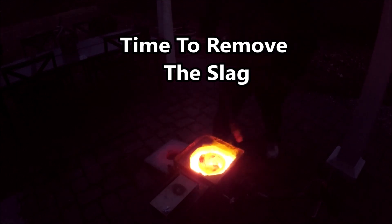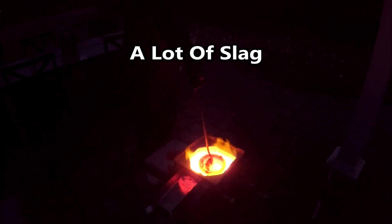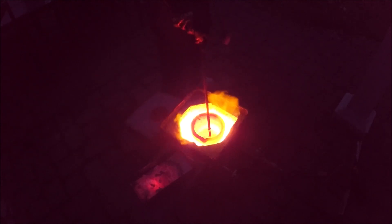I've got to get rid of the slag. I was surprised at how much slag there was — I've heard from a variety of people that when you're melting cans there is quite a bit of slag. But I still think some aluminum got caught up in that, which is okay — I can break that off and remelt it some other time. Having that table and tray there is quite convenient. I'm adding some borax and using my plunger to drive that down to the bottom to help draw out more slag. That worked out pretty well, and we're just getting any last slag.